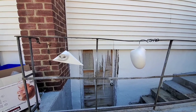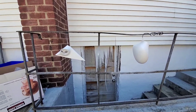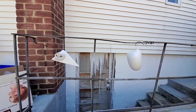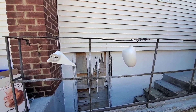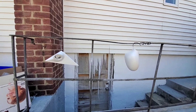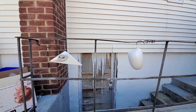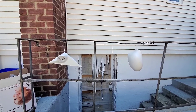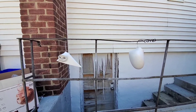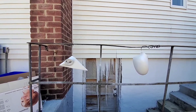Both of them have been sanded down, the primer sanded, rinsed off, and I put them up to hang. When you're painting pieces like these, your best bet is to get them hung up so you can spray from all angles. Sometimes that's not an available option, but if you're able to hang them up, hang them up to paint them. They're rinsed off and hanging right now. I'm going to let them dry really well — you don't want them wet at all because the paint won't stick. I'll let them dry maybe 45 minutes to an hour and then come back and paint.